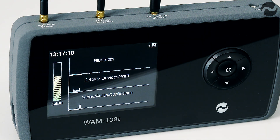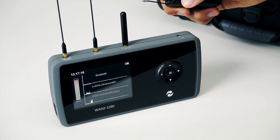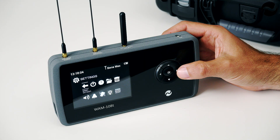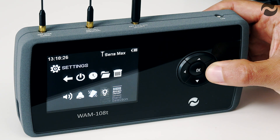The live signal strength will be shown here — as we approach with the camera the stronger the signal will get. If we switch the signal off, the signal is lost and we're now only detecting the Wi-Fi again. In the settings menu you have options to go to the main screen, power off, set time and date, view the data log of stored detected signals, erase the log, volume control for audio demodulation, beep on/off, silent vibrate on/off, panel light on/off for working in dark conditions, and band selection for switching bands on and off as required.